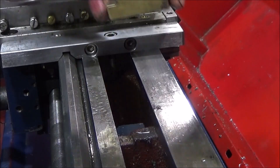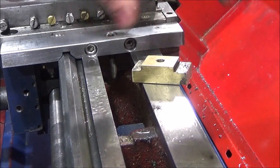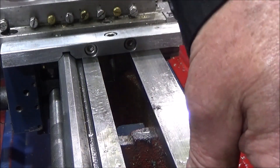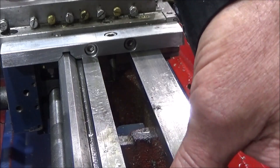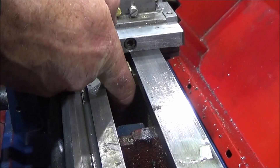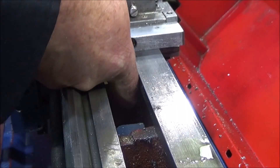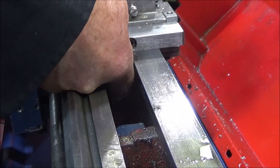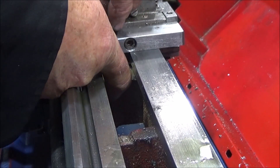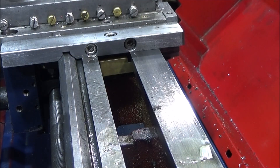I marked this one up central to the gap in the ways and drilled through with a six millimeter clearance drill, and again drilled this one out to accept the Allen bolt head — that is nicely below the surface. I then made this brass insert on the mini lathe, milled off both sides from a piece of brass, and threaded it through for a six millimeter thread, so that one goes down in between the ways and lines up with the Allen bolt, making a good solid lock.